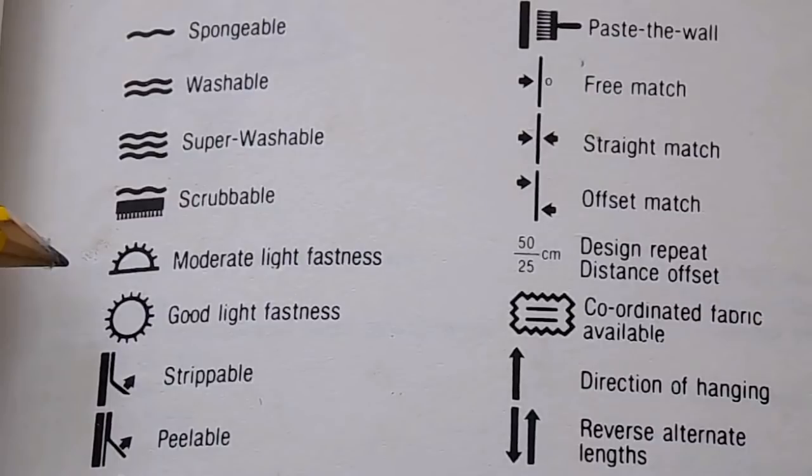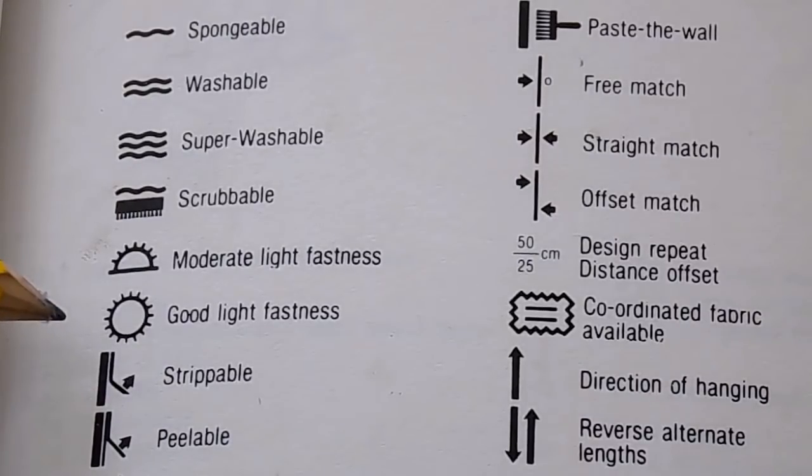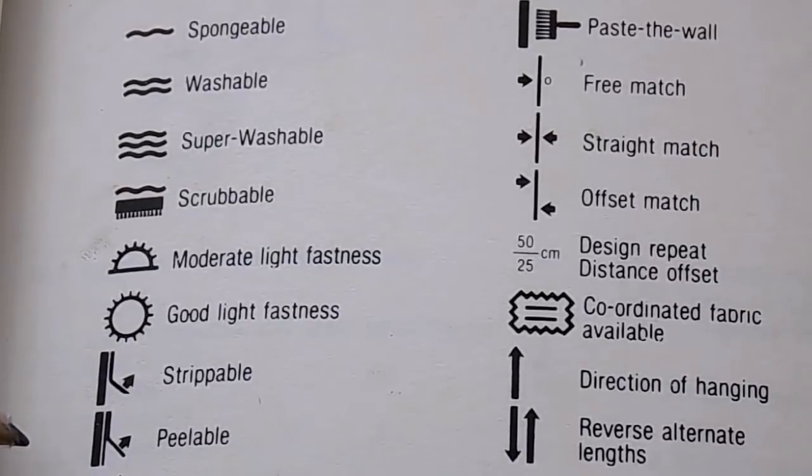That's how good the actual colours will behave when they're in the sunlight, because over time the sunlight can bleach the colours. So obviously that one, it'll take a lot longer. And then moving on to these two, this is when you come to actually strip your paper. The first one, you have to strip all the paper off the wall, and on the second one you can peel the front of the paper off very easily, and then you can actually emulsion over the backing, or you can apply another wallpaper over the top, as long as there's no edges lifting, things like that.